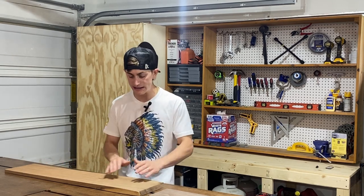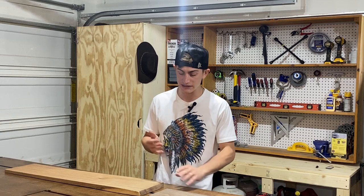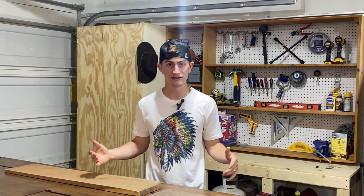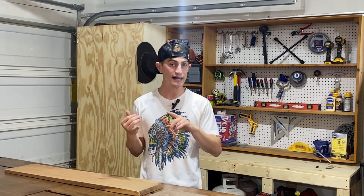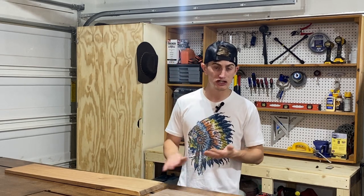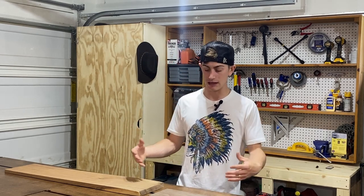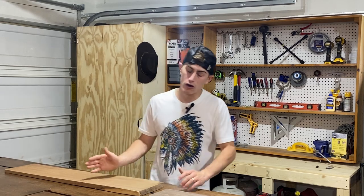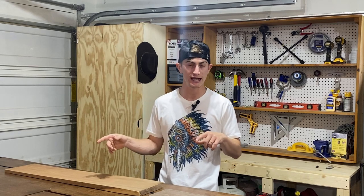This is not a usable board as-is — you can't join these rough boards; they're not going to fit together nicely, and they're not even square in some places. You need the tools to mill them. I'll assume that if you're at the point of buying your own lumber, you've already got at least a circular saw or jigsaw to cut with. But what you can't get away without is a planer and a jointer.